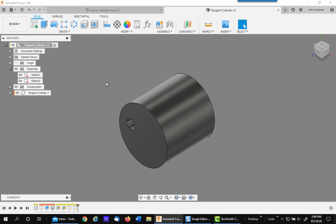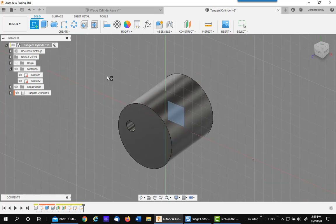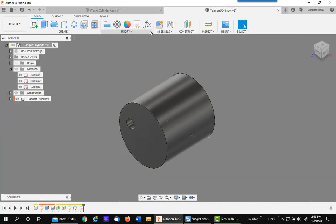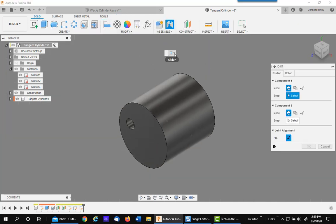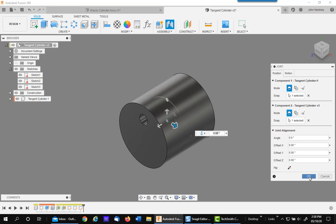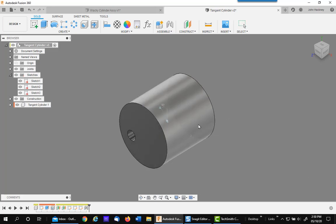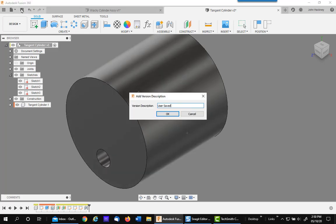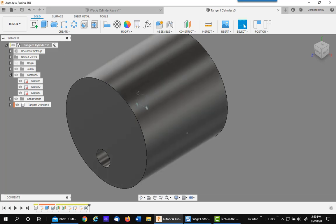We need to lock them into this part. So in the assembly, I'm going to put a rotational point in the center of this cylinder. I'm going to make a new sketch in space here and just put a point right in the center, on the origin. I'm now going to put a rotational joint between the point I just put and the center of the cylinder. So as you can see, it rotates around that point, and notice that the points stay still on the side. I'm going to go ahead and save this and return back to the other assembly.